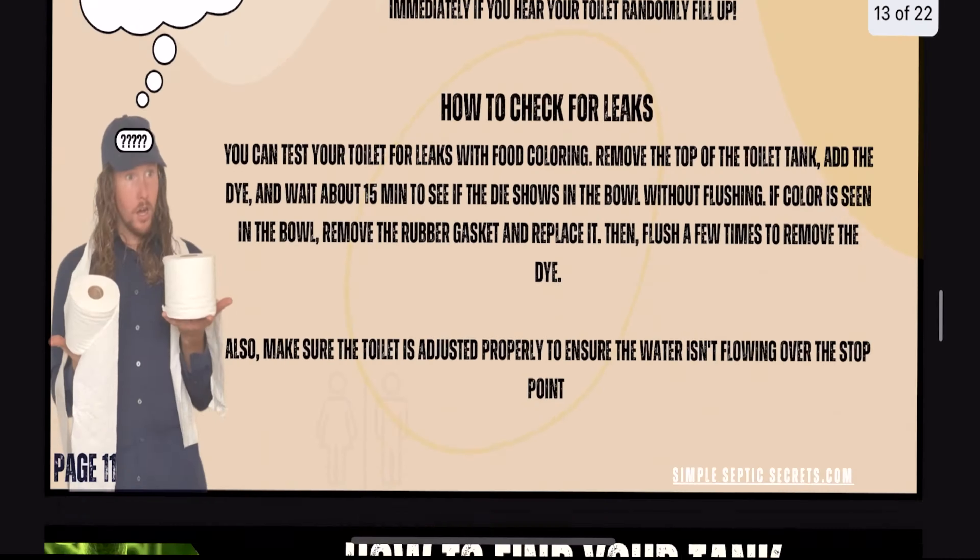So first you have to find the septic tank and dig it out. We dug up this one a little while ago but it still has to be a little bigger. For this one we're gonna need to dig it out 30 inches. You want to measure from the top of the septic tank to the bottom of the dirt where you want the lid to sit. Some people let the lid stick out a few inches and other people want it buried — this customer wants it buried, so we're gonna cut it just below the surface.